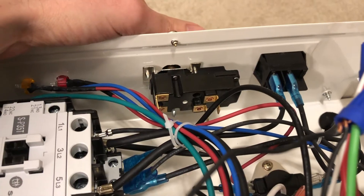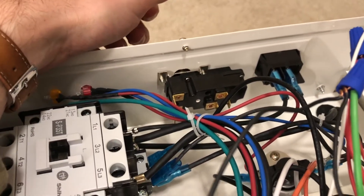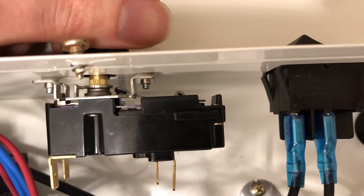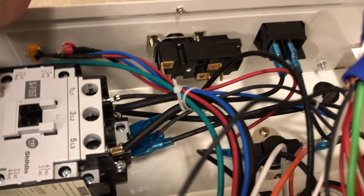The way this dial works is a bit quirky. First of all, this is going to be mounted eight feet off the floor, so if I wanted to turn it on and off I'd have to get up on something to reach the dial — I didn't want that. I want to control it from ground level. The way it works is if you turn it a little bit, there's a small piece that rises and that turns the fan on, so whenever the dial is off zero the fan runs continuously. If you turn it further, it clicks — that's the contactor turning the heating elements on and off. With this setup the fan would be running all the time unless you got up there to turn it off. That switch there controls the extra heating element.